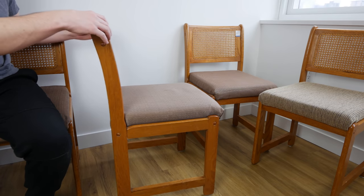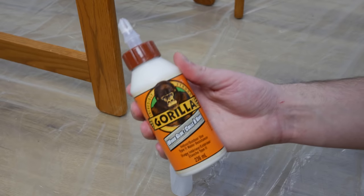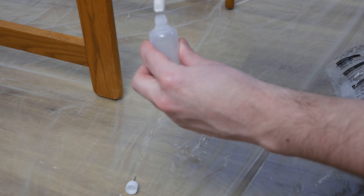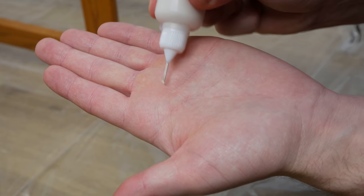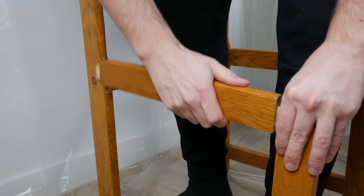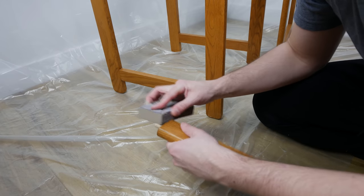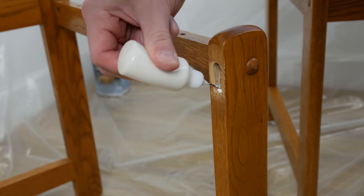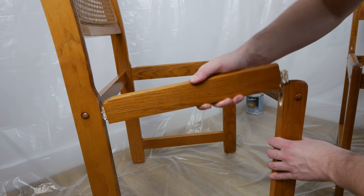The main issue with these chairs was how wobbly they were. I picked up these plastic squeeze bottles on Amazon — they're perfect for putting glue into little cracks. I threw some Gorilla Wood Glue in the container and applied it throughout the cracks. Some parts of the chair were fully loose and could come out completely. For those pieces I used a screwdriver to remove any old glue on the inside, sanded down the piece a bit, filled up the holes with glue, put more glue on the outside, and put them back in place.